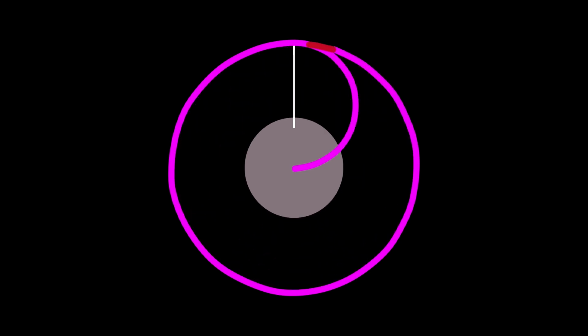Here is a hole with a 90-degree lead out. As the plasma cuts and gets near the end, at the point where the edges of the curves meet, the centerpiece drops out. After this, there is no material in the center. That causes the same situation as if you would cut out of the plate.